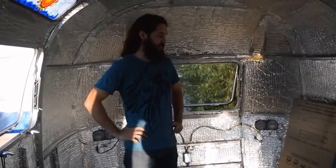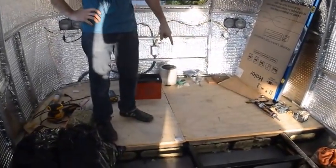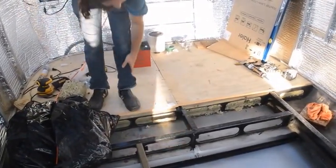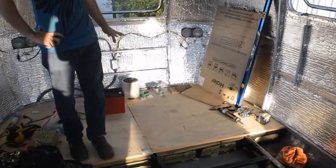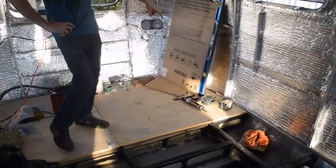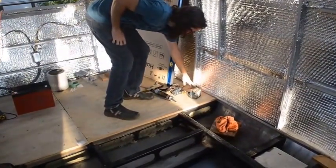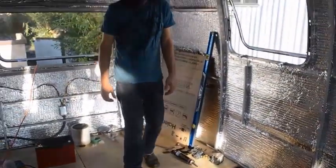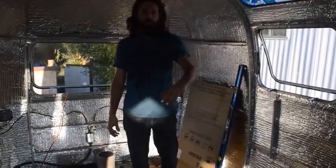We've started on the back and got the floor in. We filled everything with insulation, glued with the PL400, got it in, bolted through the frame from the outside on the ends, and framed through the floor to the channel which holds it all together. That went pretty good in the back. We still have some curved ones on the front to put on the end.